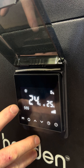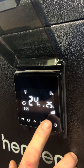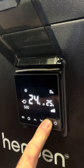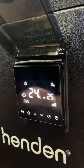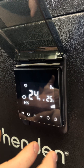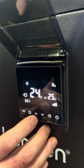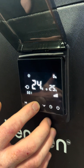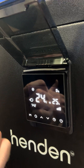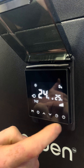To change the timer in the bottom left corner and to set the time, use the clock button. Press and hold for three seconds and release to hear a beep — you must release to hear the beep after three seconds. The timer will now flash and you can go up in single increments by tapping, or in 10-minute increments by pressing and holding. Once you've set the time, press and hold the timer button again for three seconds and it will be set.